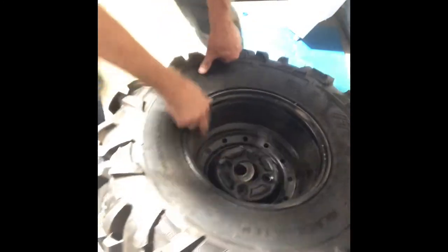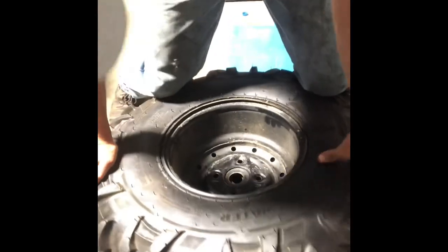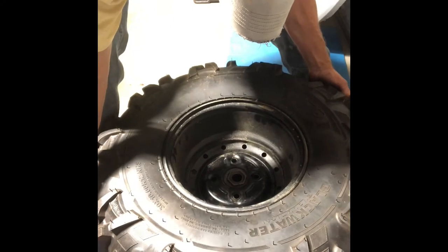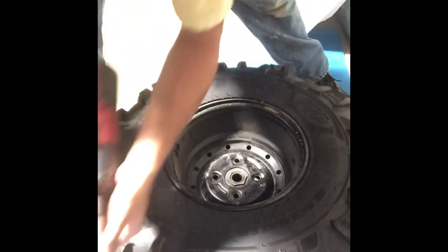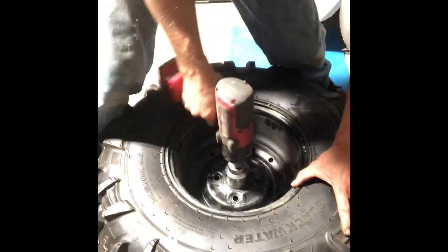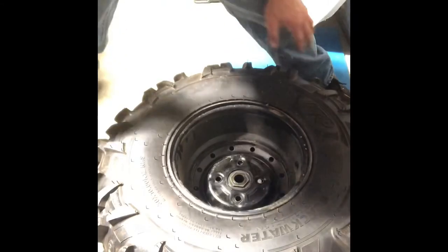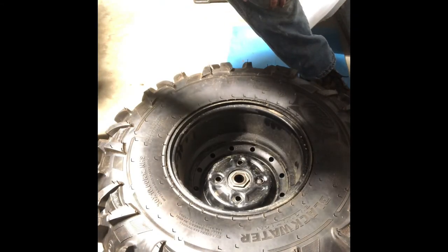As you can see, we've got the tire and wheel up on here. We're going to center it and get a little body weight down on it. And there we go — hold it. Now we're going to re-center it and take our 1-13/16 socket on a nice impact and hammer it down. The secondary spring has been changed without a compression tool.